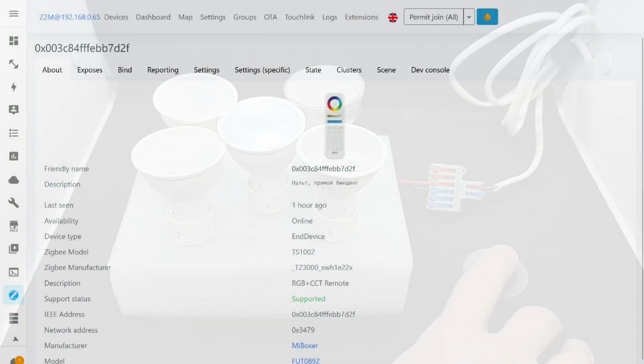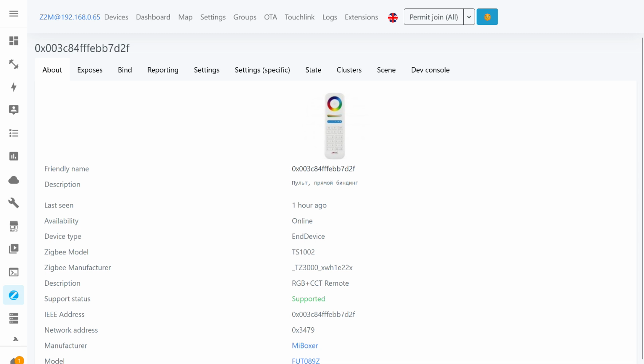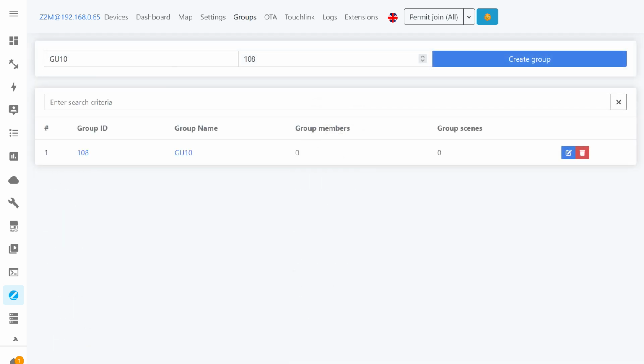The second test is with a Zigbee remote, and you can also find a link to the review in the description. It operates on the same principle, adding to groups. Moreover, it can work simultaneously in 8 groups, for which it has corresponding buttons. Details are in the review. Their identifiers are strictly defined, 108, designated for the remote's large pair of buttons, the most convenient ones.